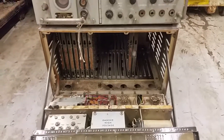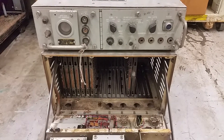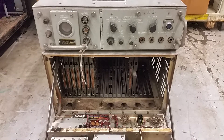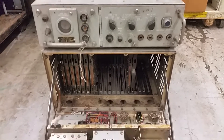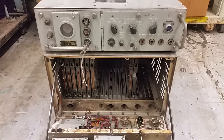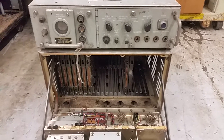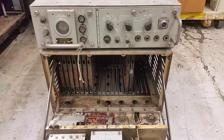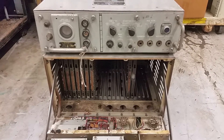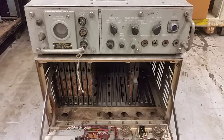How well this worked, I don't really know. I think these were made to receive Morse off the air through one of the standard military Navy receivers and then feed a teletype machine to be either punched on tape or printed out, or both. I don't see why you couldn't feed this Morse by hand with a 1000 Hz code oscillator — though you'd probably have to have a pretty good, stiff fist to form the dashes and dots properly. I don't know how much timing slop there is; clearly some.